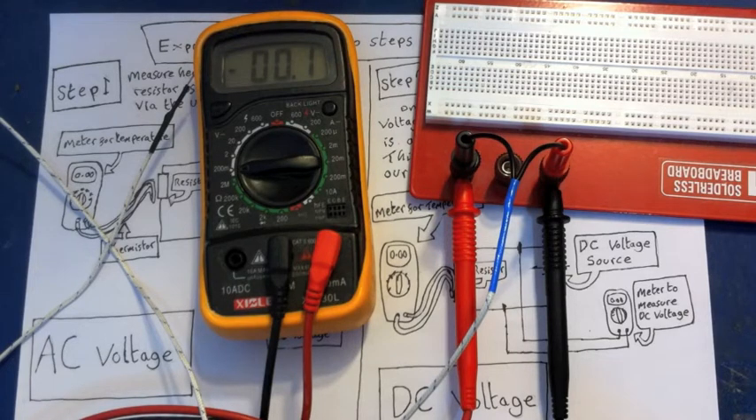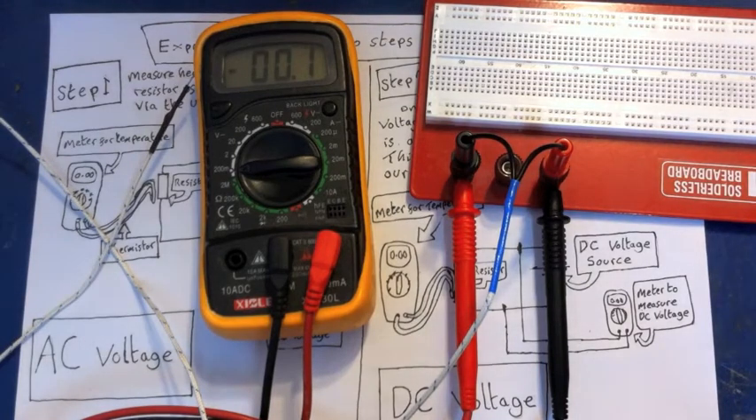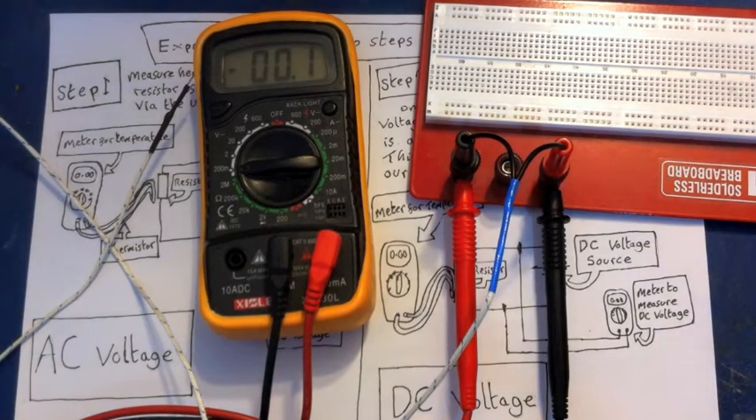You can measure a voltage difference at the ends. Now we'll let it cool down, then the electrons will soon return to their original state. So if we can keep the heat constant, then the voltage value showing will also stay at some fixed value. This then allows us to use this millivolt reading as a proxy for temperature. Basically, we've built ourselves a thermometer — it's crude, uncalibrated, but perfect for this experiment. Plenty accurate enough to measure the ratio of two voltages: an AC voltage and its effective DC that would produce the same temperature value.